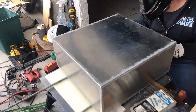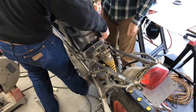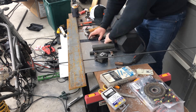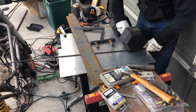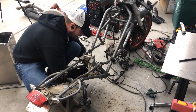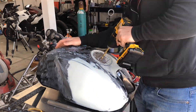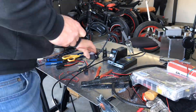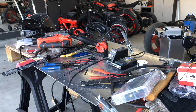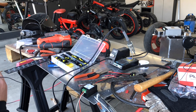I used 3/8-inch threaded rod as studs for mounting nuts to attach the lid to the box — just drill a hole, weld from the backside, and grind it flat. I cut the notches and widened the opening for the battery case, test-fitting everything as I went. I also worked on the charge port — a DC power three-pin connector, similar to a computer monitor. For the volt/amp meter and battery temperature sensor I measured placement and wired up disconnect cables, using two pre-made pins and soldering the wires on. Both signals are just 12-volt power or a closed-loop sensor circuit with a resistance reading, so even if switched incorrectly it wouldn't cause harm.